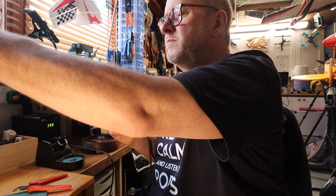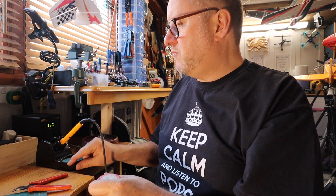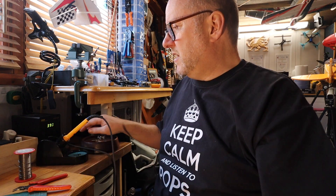So after you've finished soldering, just clean the tip of any debris or corrosives, add a little bit of solder, turn it off — job's a good one. Let's go back to the main bench. A couple of little tips for soldering — I thought I'd keep it simple.